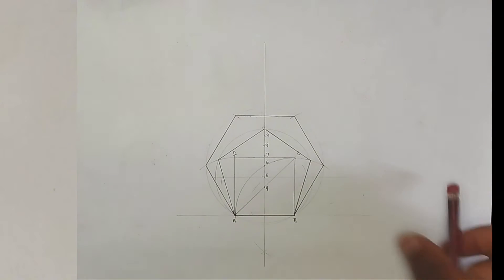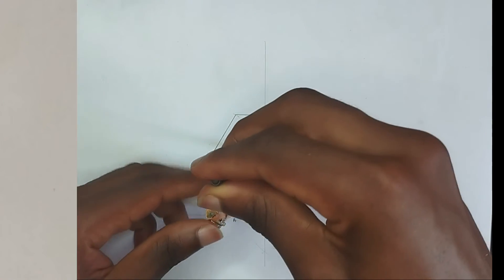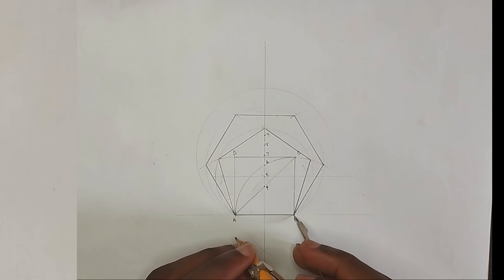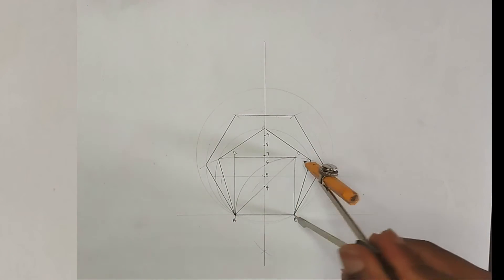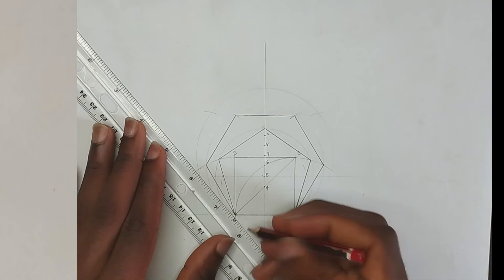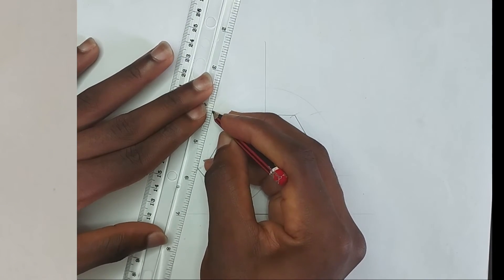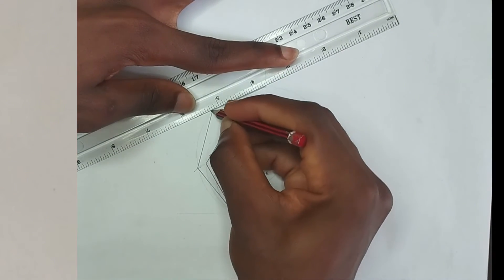Now I'm going to move to the polygon of seven sides, which is the heptagon. I will extend my compass from point seven to point A, then draw my circle using the 40 millimeter length of AB. I'll strike an arc here, place my compass at the next point and strike an arc, then at the following point also strike an arc. Joining these points together, we are drawing our heptagon — the polygon of seven sides.